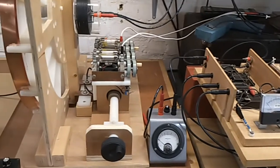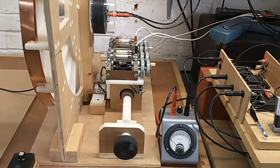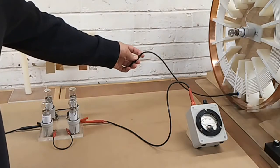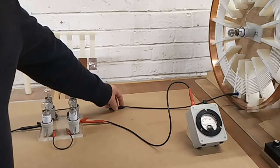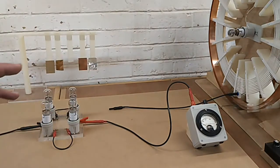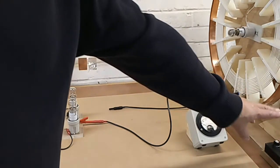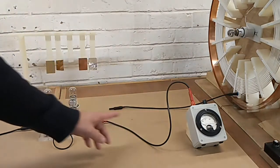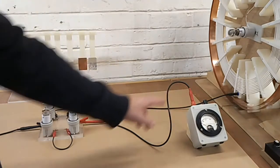This is set up to measure small signal AC analysis. Now we're looking at the output of the transmit coil — we can see a small lead at the base output of the secondary coil, which we'll leave disconnected for now. The first impedance measurement we'll do is at the inputs of the primary coil — in effect measuring the tuning unit and the properties of just the transmit coil, primary and secondary together. There's an RF ammeter connected through to the single-wire experiment section.